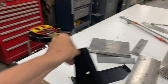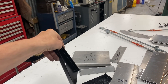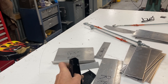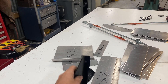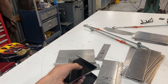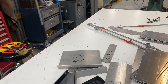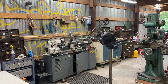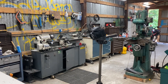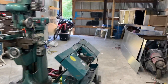I'm thinking they'll hang through a hole something like this so I can powder coat them. I'll probably get some Faraday action from the powder coating machine — powder coating can be hard to get into recessed areas, so it'll be interesting to see if I can get the powder to sit up in there. Luckily it's on the inside of the part, so if there's a little bit of a holiday in there I won't stress too much, but hopefully I can get my settings just right. I'm also shooting a how-it's-made video this morning on these — I don't generally edit my videos, but this one will actually show how that's done.